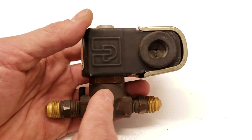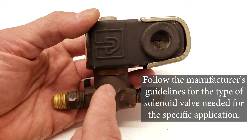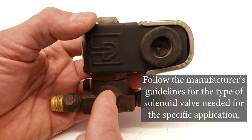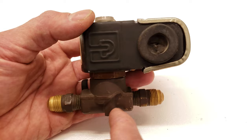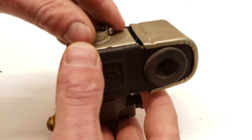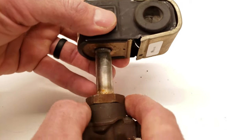This can be found on some heat pumps with a long lines application, or where the heat pump compressor is located much lower than the rest of the system outside, where it may be in a low ambient condition. The point of this is to stop liquid from migrating to the compressor, because that will be bad at startup. This can also be found on automatic pump down refrigeration systems, which I'll be showing you in just a little bit.